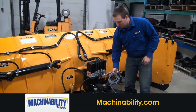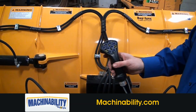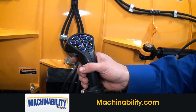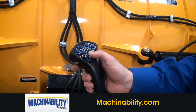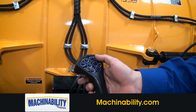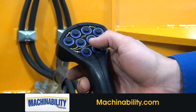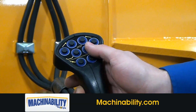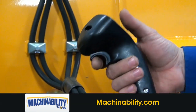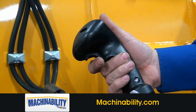I'll show you here the joystick that comes with it. This will get mounted in cab on the hydraulic lever. Once powered, you engage flow on your hydraulic lever and these buttons are then active. The top two buttons control the right wings individually forward and backward, the left wing forward and backward, both wings forward, both wings backward, and the angling of the plow. On the ag application there's also a trigger for lifting the blade up and down.